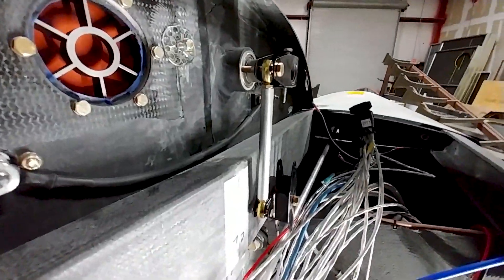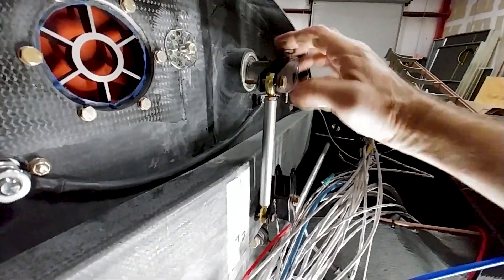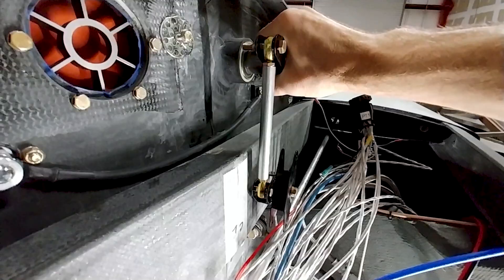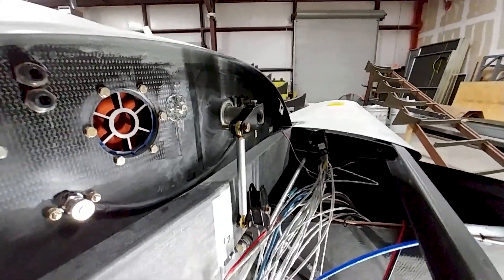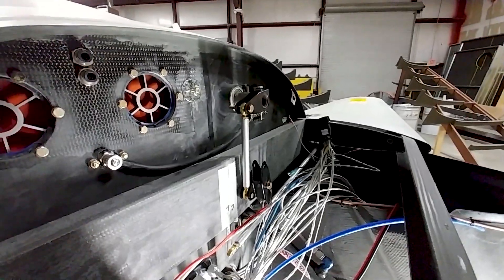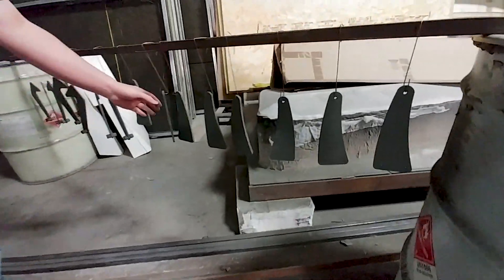That's what it looks like on the outside. I had to clear out a little section on that bottom bell crank because I was getting interference there. Not having done this before, you kind of forget about some things that are going to collide with each other, especially in SOLIDWORKS where you're not always looking at a full animation of how something moves.